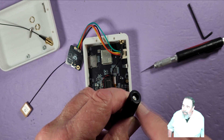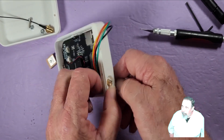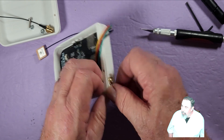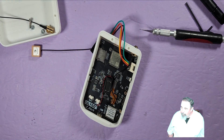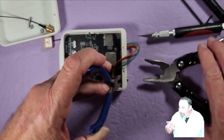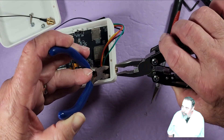I made the mistake of putting the nut on and tightening it onto the antenna connector first. I'm getting the lock washer on there, the nut on there, and cinching it all up with pliers. But once I get this cinched up, there's not enough of that SMA connector left to fully engage the male-to-male adapter. What it results in is the antenna will just spin freely the way the adapter is manufactured.